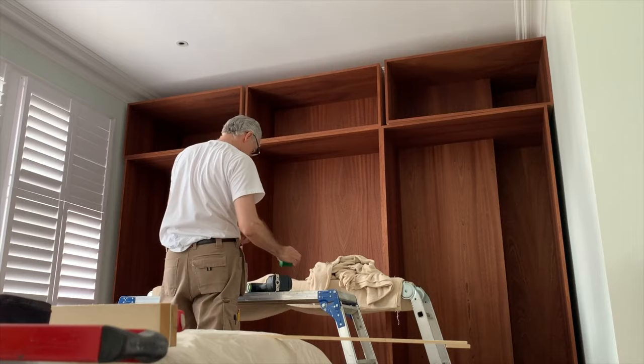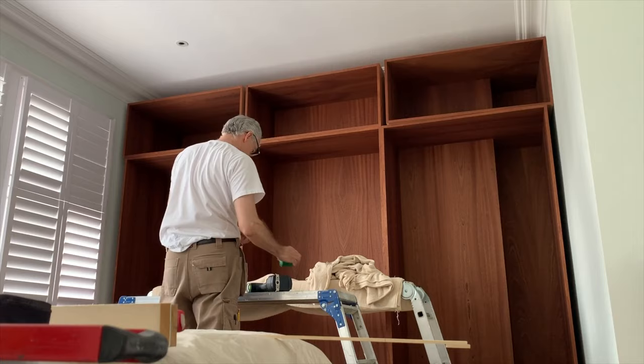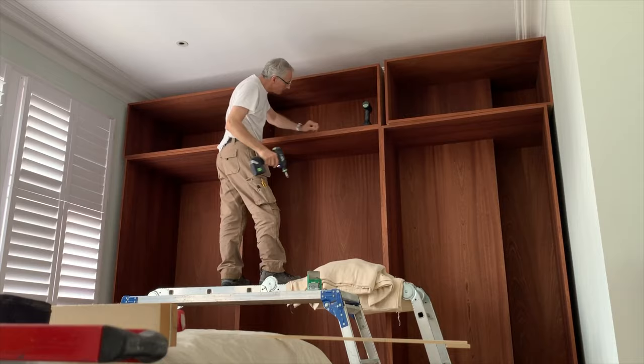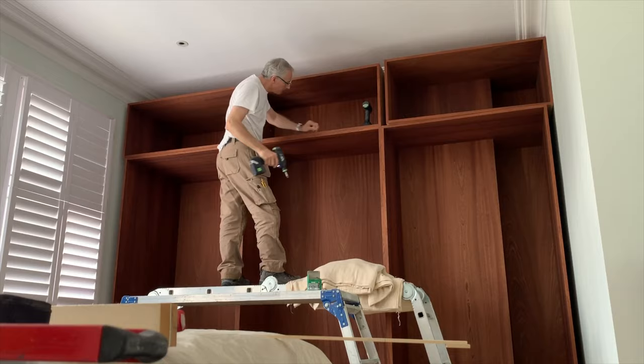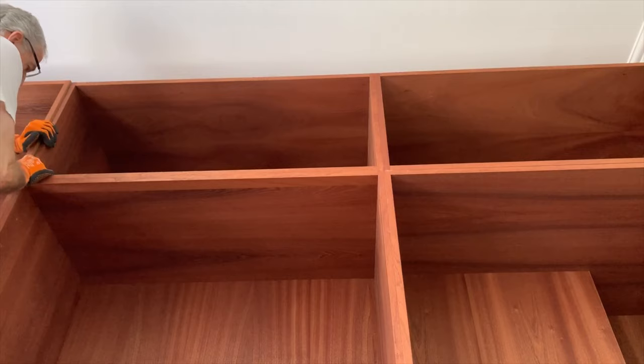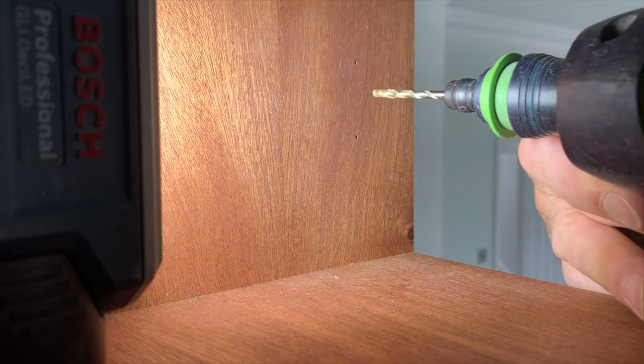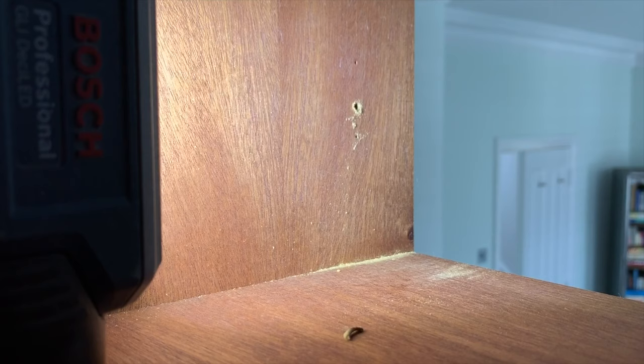After it's centered I drill through the base of the top box and screw the top box and wardrobe together, which not only secures them but also helps stop any sagging over this kind of span. With the center top box fixed I can shuffle the surrounding boxes into position and fix them to their wardrobe carcasses in the same way. Back in the center top box I drill a pilot hole and screw the boxes together at either side, positioning the screws carefully so the hinge plates will hide any fixings. I do the same with the wardrobe carcasses lower down, screwing them together at each hinge position.